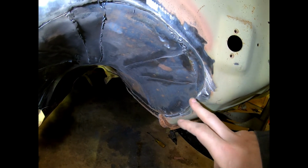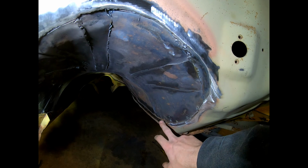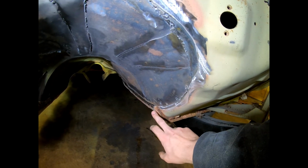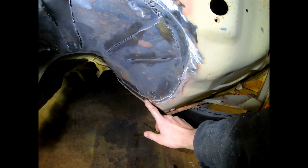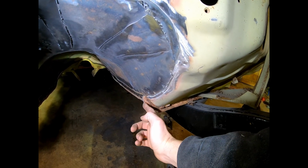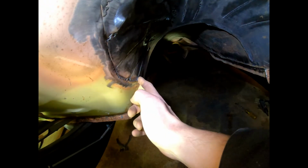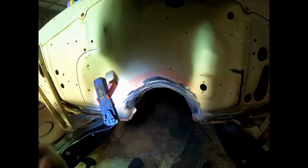All this is cut down. Now this is gonna need a heavy weld. And I'll have to feather this point down, this brace, I don't know where the metal meets from the floor pan to the firewall. I'll feather it down to a point. I say like this, it'll actually come out like that. Same with this side, I'll taper it down. But to me, it already looks leaps and bounds better just looking at it and smoothing a lot of these top welds down.